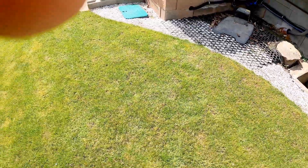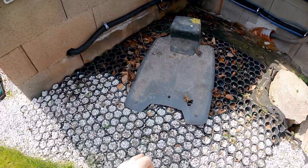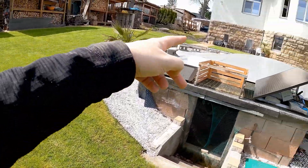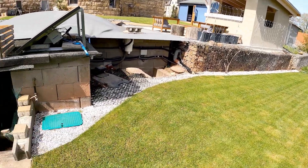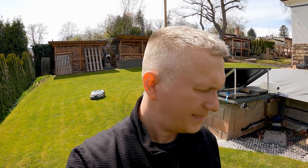Now the question is how I find the damaged spot of the cable. The cable runs in the middle, coming out of the charging station, making an arc, then running right in the exact middle of the lawn and underneath the sidewalk. From there it continues through the middle of the upper lawn, under paths, and past the blue house somewhere. My problem is that the damage is not superficial — I cannot see where the cable is defective because it is buried about 10 cm deep in the ground. For this reason, I will be using a transmitter with a probe to locate the defective cable underground.